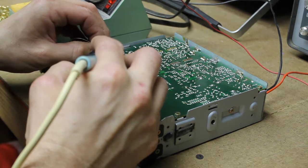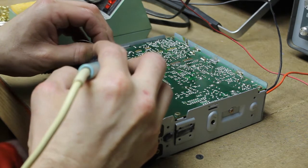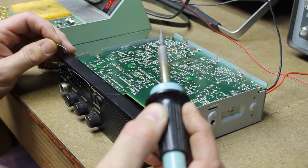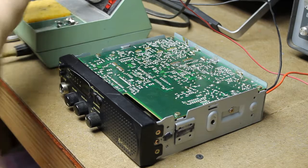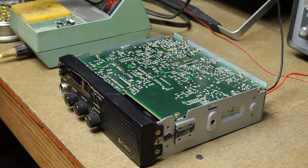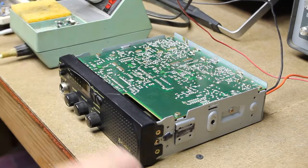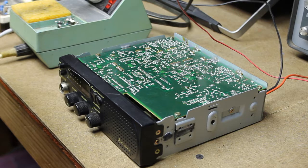The board material they used here, when it gets hot, it smells pretty bad. That's looking a lot better. I think one thing I'm going to do is get my finer tipped iron down — this work is possibly too fine for the chisel tip iron that I have. So we'll go ahead and fire up the fine tip soldering iron and go from there.